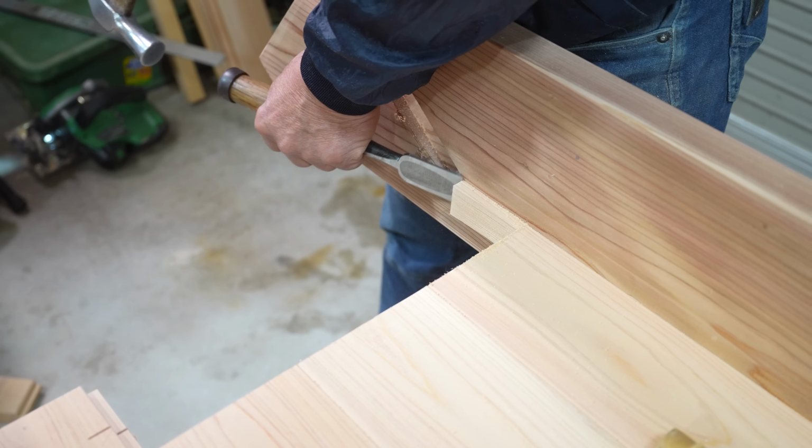As mentioned earlier, the platform is on the inner side of the slide sides. Thus, it was barely wide enough for an adult to slide down. Because the nuts on both sides can hit the hips, I drill counterbores. It would have been easier if I could drill them before assembly. I use round flat washers, since the outer side has a round shape.